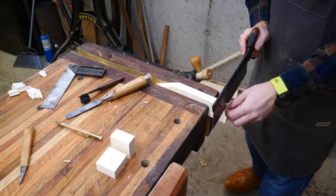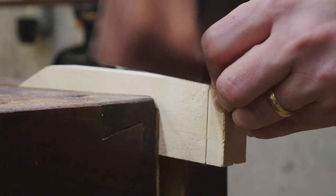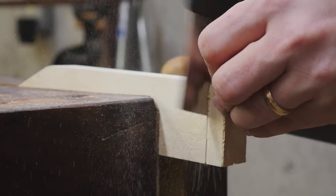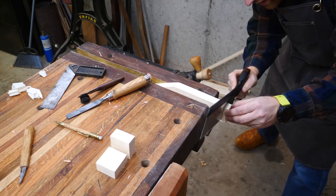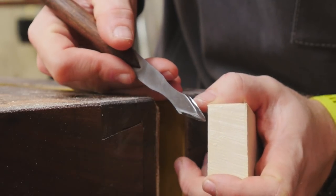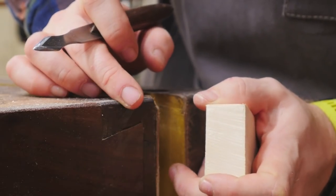Now what you have is this notch that kind of pulls the saw over to that marking gauge line, and you should be able to get all the way down. Take your time, follow the line, and let that knife wall pull the saw along. You may have to do a little bit of cleanup, but if you do it well, you might not have any cleanup at all, and you can have a usable joint right off of the saw. And there you have it — I've cut flush on that line all the way along, got a really nice cut. If you look closely at the end here, you can still see the knife wall right here where I cut down to that point. There's a really nice clean line — one pass with the plane or chisel and that is a perfectly smooth end, ready for work.